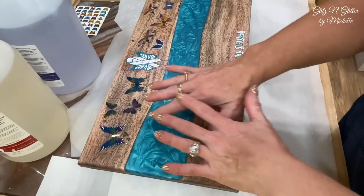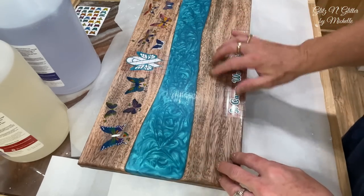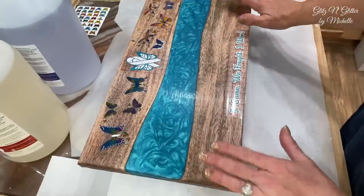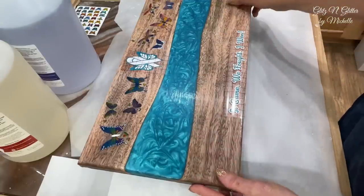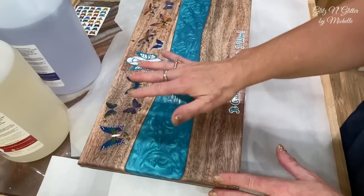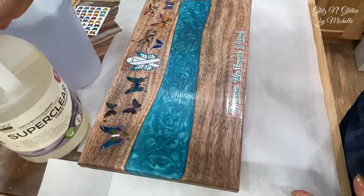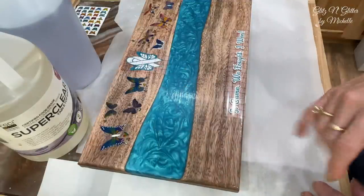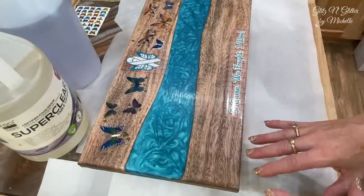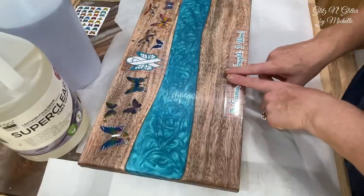So right now I'm just going to put down all the butterflies. So we seal coated this twice. Then we took some sandpaper and got it a little flat, so there is a small portion of epoxy on this. Once these are all on, I'm going to spray seal it with some clear sealer to hold them down under the epoxy. And then I will be using my food grade tabletop epoxy on this one, because I don't know if she's going to be using it with food, and I want to make sure it's safe for her. So I'm just going to go ahead and get these all laid down